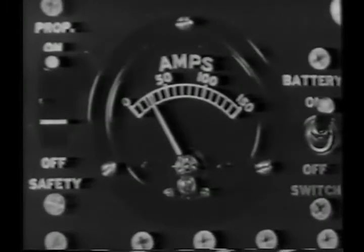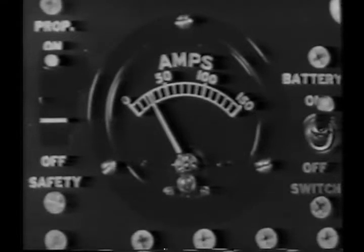When the wheels are fully extended, the pop-up indicator on the nose cowling and one in each wing panel will be visible. The travel indicator will be down and the ammeter should read normal. In making your approach, you'll find that with the P-39's excellent visibility in all directions, you will not have to make a close turn to keep track of other traffic in the air. You can come straight in if you want to.